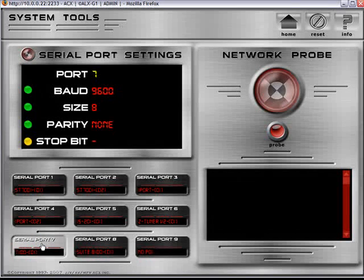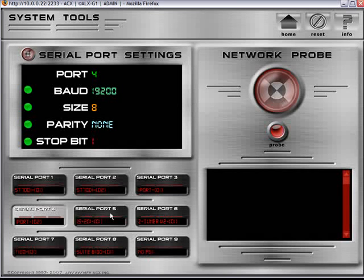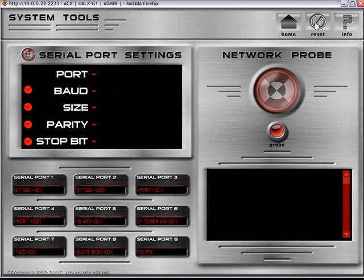Double check your cables. At ACX, we cannot stress the importance of having the correct DB9 cables installed. Also, make certain that they are the correct type of DB9 cables. If your component calls for a null or crossover DB9 cable, be sure that a null cable is installed. However, if your component requires a pass-through DB9 cable and you have used a null cable, it will obviously not work. Always test your cables with a testing device to determine continuity as well as type, whether null or pass-through.